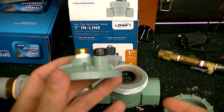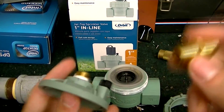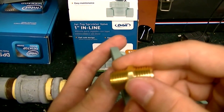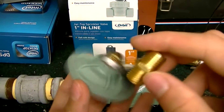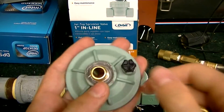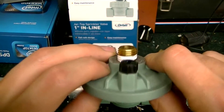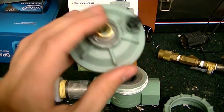I filled in the rest of the gaps with more epoxy, so you can see it's completely sealed. Because I didn't tap it all the way through, the fitting had to bite into the plastic and was in there very firmly. This piece is not going anywhere — it's cut into the plastic and then completely covered in epoxy. That makes sure it's in there very well, and that's the only hard modification you have to do.